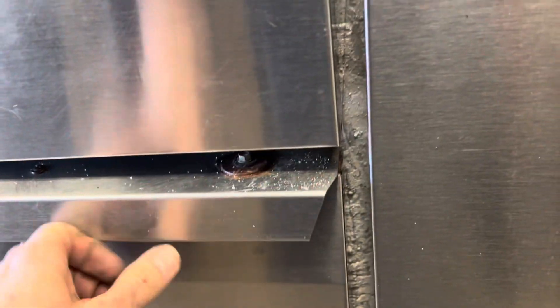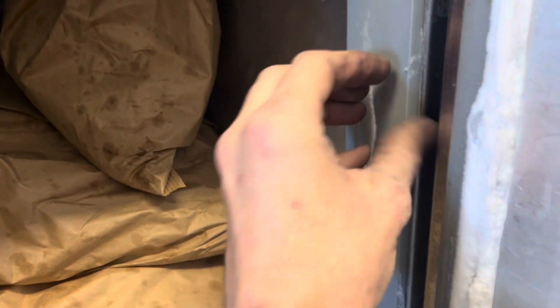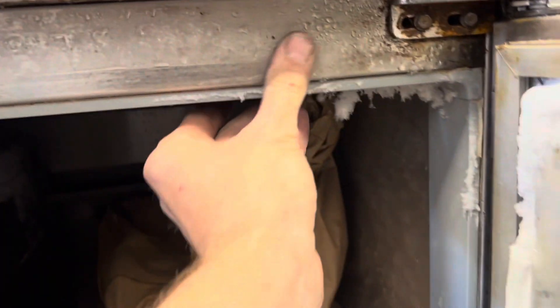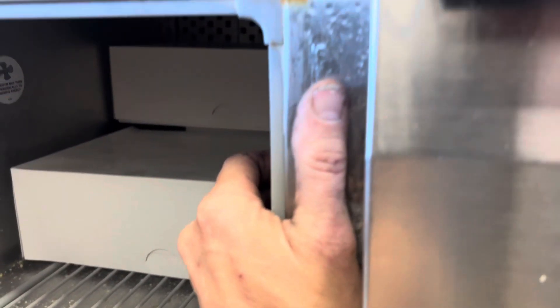The gaskets or the door is just not shutting. Looks like that's getting sucked in. Also, there's supposed to be door frame heaters — that may be what's going on. There are no door frame heaters active; it doesn't feel like it.